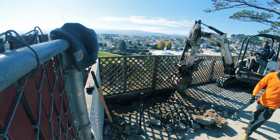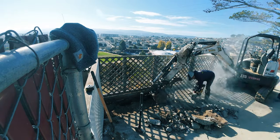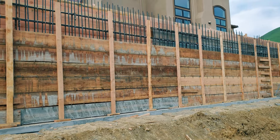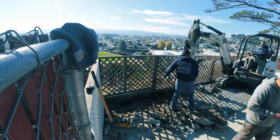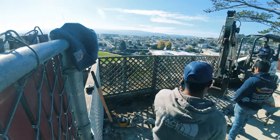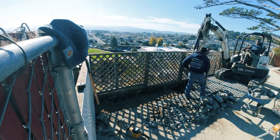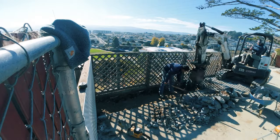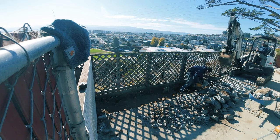This one here is pretty straightforward for us — it is a pier and grade beam system. We did pour monolithic; we figured out how to pour these walls monolithic. Ideally you have three separate pours: the piers, the grade beam, and the wall. But we poured everything monolithic, which makes this wall that much stronger. You do have to know what you're doing because if you dig the piers and they collapse the day you pour, it can become an issue. We normally make that call once we get out and feel how the soils are.